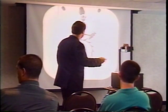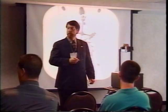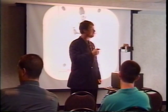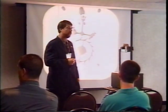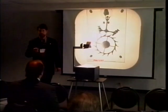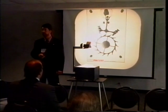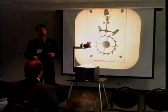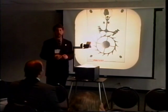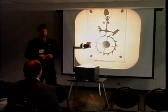All right, so now we're ready to start talking about the pallet stones, and what's the rule of thumb when we talk about either the amount of drop lock or the amount of total lock that the pallet stone should have? A third. When we talk about total lock, sometimes I've seen it referred to as a sixth when you're talking about drop lock. So in other words, drop lock might be half of total lock, or total lock might be twice as much as drop lock, okay?